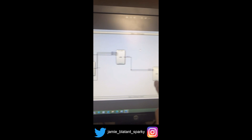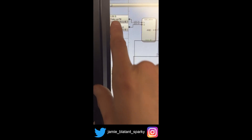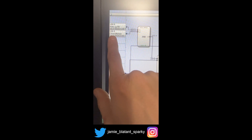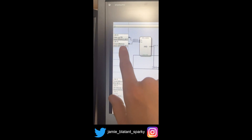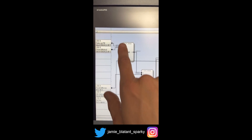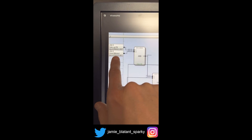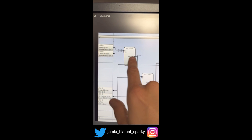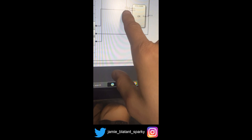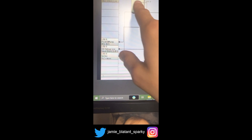There are things in the middle that need to happen — this is called logic. Over here we've got one called make-up fill, which is a key switch. So we've got make-up fill — a switch that lets the pump run. Then we've got the clean oil pump is selected. When you turn the key switch and the clean oil pump is selected, both of these will go positive. This is an AND gate: that and that being on will make this go out. So if the clean oil pump is selected and the key is pressed — both on — this becomes active and gets through to here. That's the manual operation. This one here is an OR gate — so that or that can make it work. So as well as that being on, when they're both active it comes out and hits this OR gate.